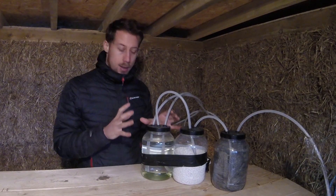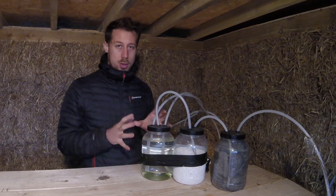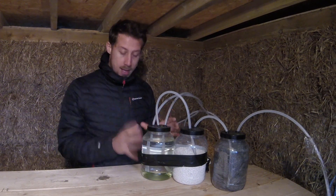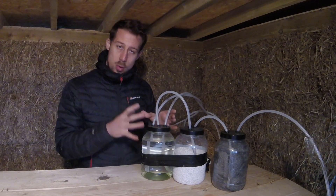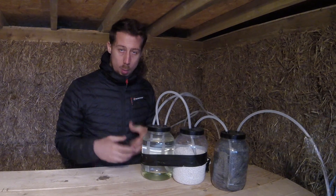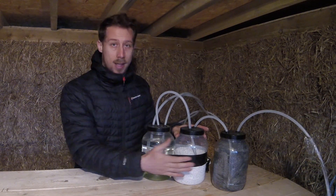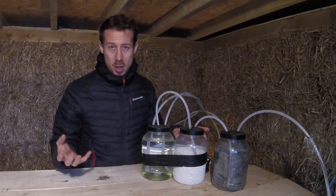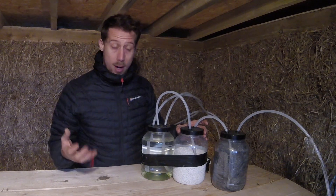So we have our water taking out the carbon dioxide. It also takes a little bit of the hydrogen sulfide out, but that is not the main aim for the water. Then, after passing the gas through the water, we want to take out any moisture, because moisture will also corrode any kind of metal it comes into contact with. To do that we're using cat litter. Other people use silica gel, but cat litter is cheap and freely available.